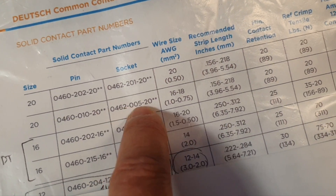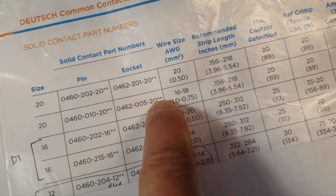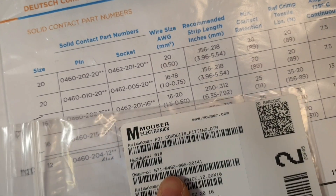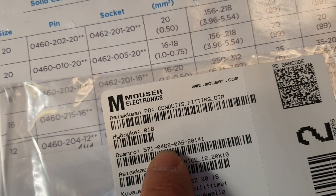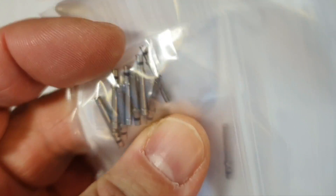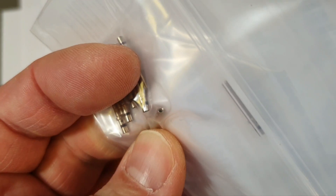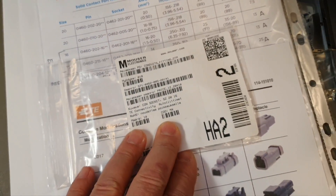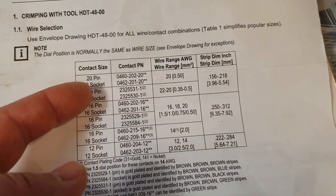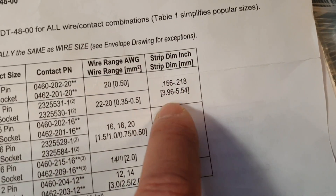The contact material is 31 for gold and nickel - I couldn't buy gold for DTM so it's nickel. That part number is the socket contact for the plug. On the short side you put your cable and crimp it, and to the opposite side the mating contact will go. For stripping we follow the documentation - for size 20 contacts we are in this range to satisfy the requirement. You can use a stripping tool but in my experience you later need to check and adjust anyway.